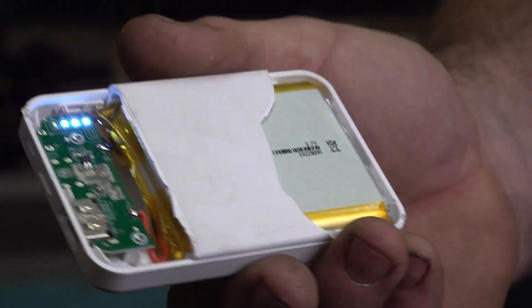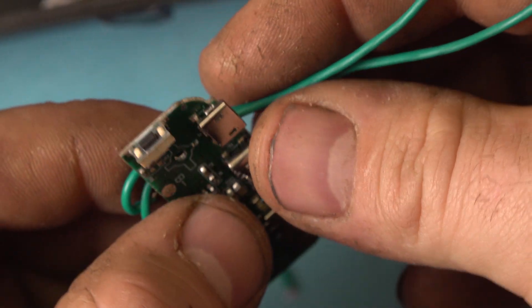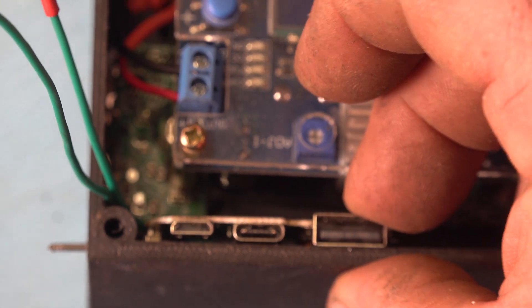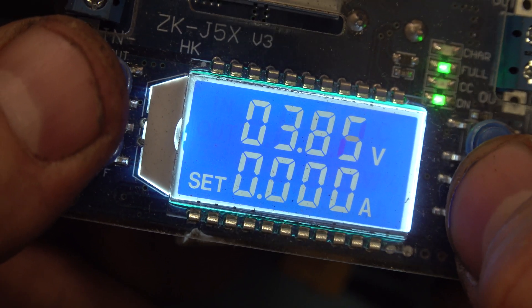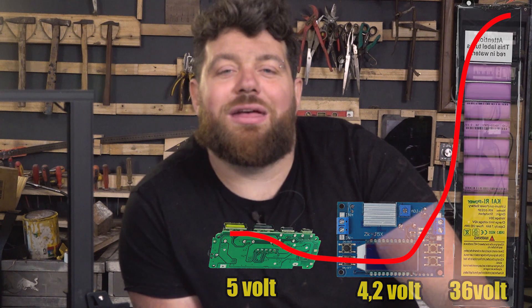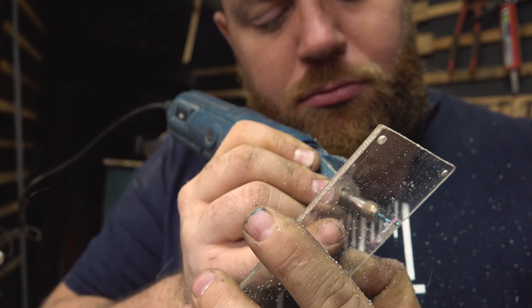The solution is very cheap. I have an old power bank that is broken — the battery is dead — but the circuit board is still working. I know for sure that these circuit boards can filter and stabilize power, so even if there's a spike it stabilizes it, and even if there's a mistake, it will fry the little circuit board but not my iPhone. I'll glue it here on the side using polyurethane glue — be careful, silicone doesn't stick to plastic or plexiglass. I will power it with only 4.2 volts; this circuit board works between 3.7 and 4.2 volts, so it acts as a step-up converter, taking 4 volts and bringing it up to 5. Now I just close everything with some plexiglass.